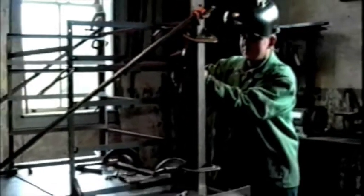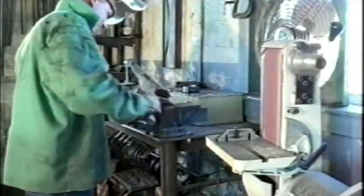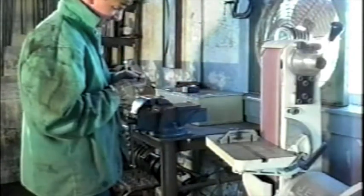After all the elements are cut, I will start by welding together a carcass. Door frames will be welded up and side panels will be welded onto legs. For hinges, I'll generally cold form and hand hammer strips of steel around a pin.